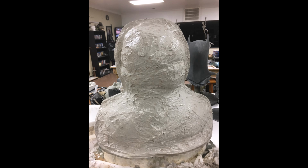So you also like to have this mold set up by itself untouched. Once you're completed, let it set up for 20 to 35 minutes. The mold will start a chemical reaction. It'll get very hot and hard, and you know that the mold is ready to be pulled. Some people wait overnight. I typically don't. I just wait until I can use my fingernail to scratch the surface of the mold, and it no longer leaves a mark. That's how I know that the mold's done and ready to go. And so then you just carefully remove it.